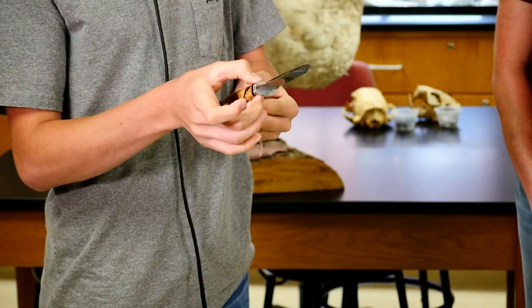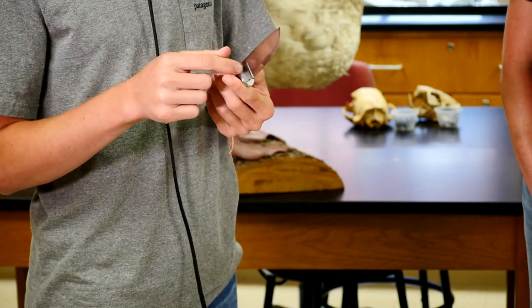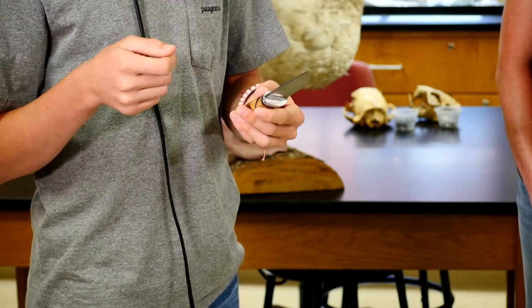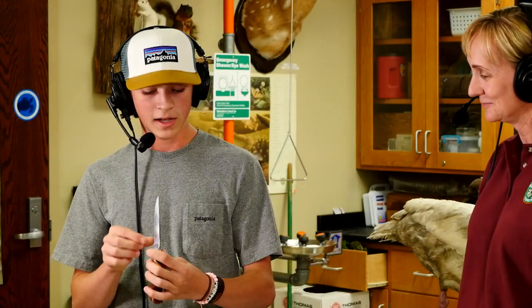One of the hard parts is right here: you don't want any gaps between the blade and this guard because it's two separate pieces of metal. So you really have to take your time filing it super tight, where a thousandth of an inch can matter. It's just hours of filing, and you'll sit there and file for 20 minutes and maybe take off a thousandth of an inch because you're trying to be so detailed and accurate. When you do the slot in your guard, it has to be super narrow, but you can't just drill a hole down because it will normally end up wider. So you drill one hole and then file all the rest of it out, which just takes hours.